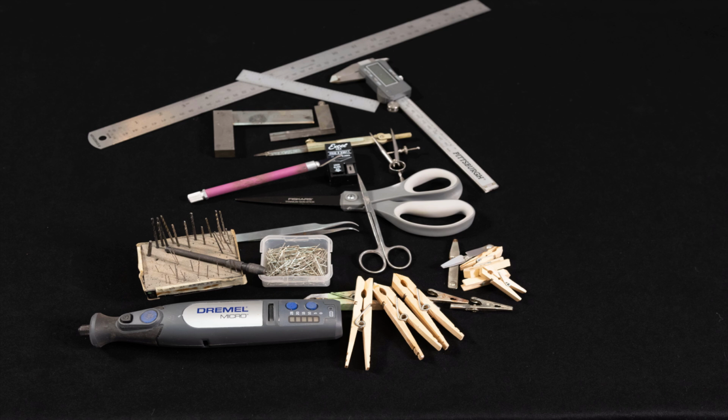And I would go for, on the sandpaper, maybe a sheet of 150 grit paper and a sheet of maybe 220 grit paper. That's really all you need. And for the emery boards, you can get grits that roughly match that. They usually come in combinations of one side would be 100 grit and the other side would be 180 or 240 and 400s. Anything like that is fine. And that would be plenty for a project like this.